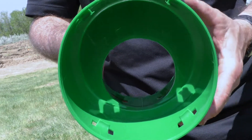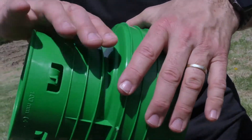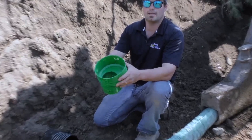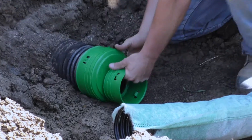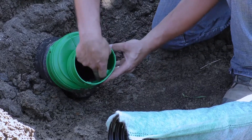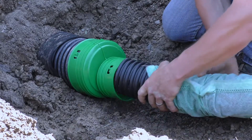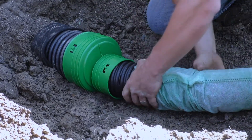The use of a reducer allows you to switch from one diameter to another. What's new is the locking clips. This reducer fits on all types of pipe, and when slip-on, it provides good retention at the drainage level — it truly won't move. At the 4-inch level, it comes with an inside stop line that ensures the 4-inch pipe won't go too far into the reducer. Once clipped, nothing comes out — everything is tight.